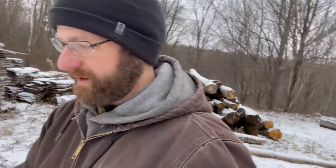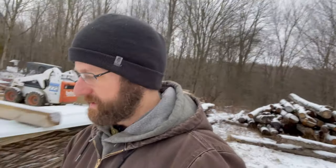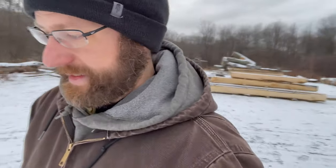I'm going to try a little bit of a different video style, if you will, this time. So I'm going to kind of go through some descriptions for each log before, and then kind of what the final dimensions are. And like I said in previous videos, really all I'm trying to do is make the largest possible cant or square timber as I can out of each log, and then that way I can more easily assess what I have in total. So that's the goal for today, and I'm gonna go ahead and grab my level so I can work on re-leveling that bed, and then we'll get the sawmilling once the tractor gets warm.